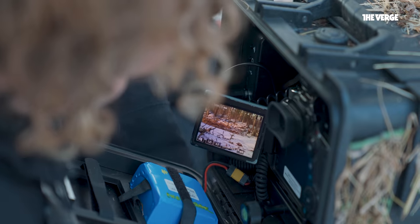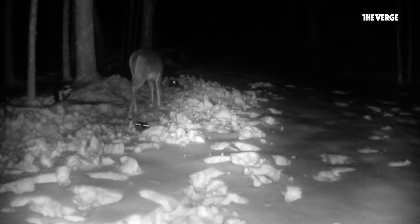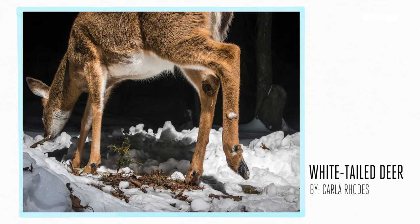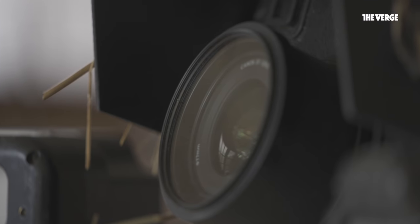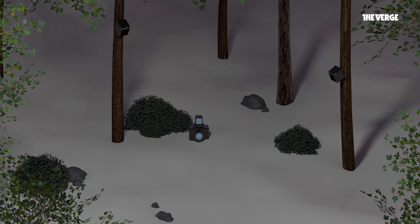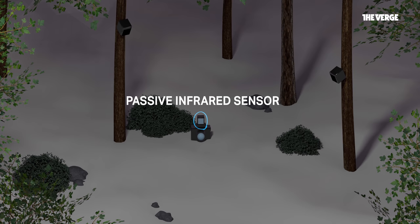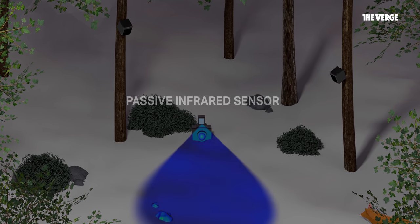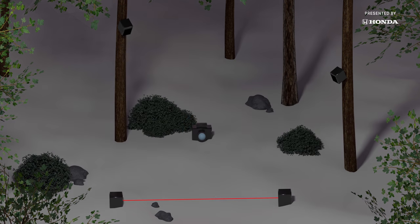In the fall of 2019, I got the camera trap setup that I use now. Camera trapping is the process of leaving a camera and a trigger system out in the wild in hopes that an animal will walk by, trip the sensor, and be captured by the camera. The camera is typically kept in protective housing, and when done ethically, the flashes are placed well above the animal's eye line. One common trigger method is a passive infrared sensor, or PIR sensor, which typically detects abrupt changes in heat in a coned area, then triggers the camera and flashes.